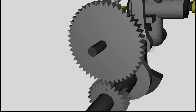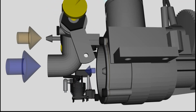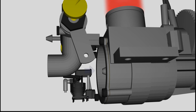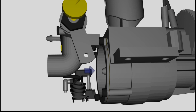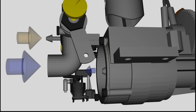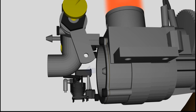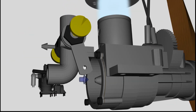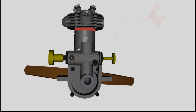Let's now have a look at the ventilation of the crankcase. To avoid the loss of oil, the whole motor is sealed. If the piston is ascending, a negative pressure is generated inside of the crankcase, which is why air is entering the housing. While the piston is descending, a positive pressure is generated and air is coming out of the crankcase. This pin is normally connected to the upper side of the tank to be able to contain the oil spray exiting the crankcase with the air.